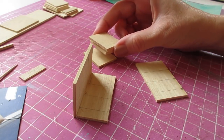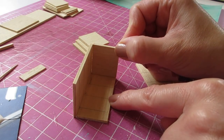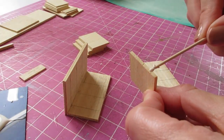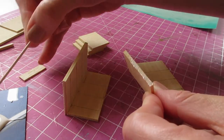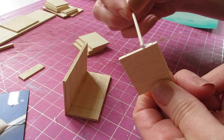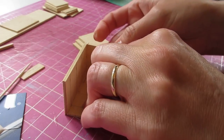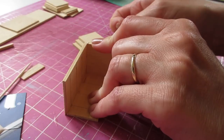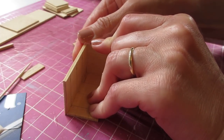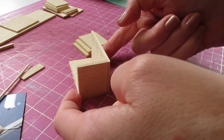Bring in one of the four identical pieces — top, bottom, and two shelves — and attach it so it sits on the inside edge of the joined pieces, flush to the top. The cutting list advises cutting these so the shortest edge runs in the direction of the grain, as that edge faces the front of the unit and is always neater. Press into place making sure you've got a flush line along the top, getting the back flush first then pulling in the side piece to meet it. This gives us a nice flat top to eventually attach the desktop to.